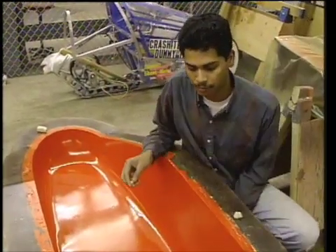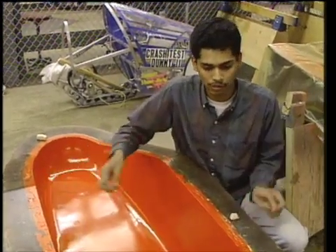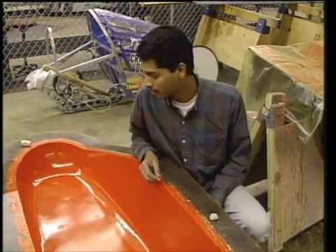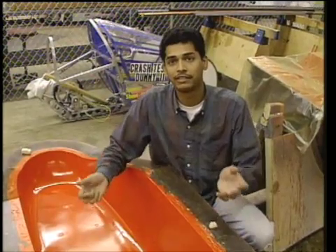Because of our difficulty releasing the top shell, we decided to make some additional mold modifications as this student explains. Since last time when we pulled the mold out, we had trouble with it because of the surface tension — the shell would stick to the mold. Now by having these holes, which are about a quarter of an inch diameter, we can have dowel pins in there, so it will be easy to pop out.